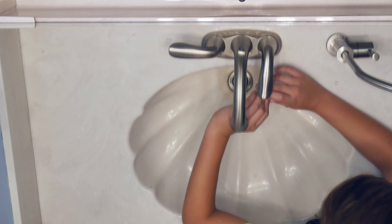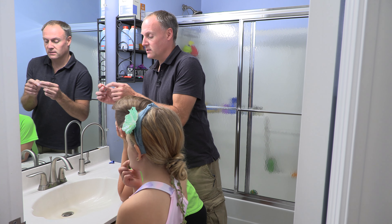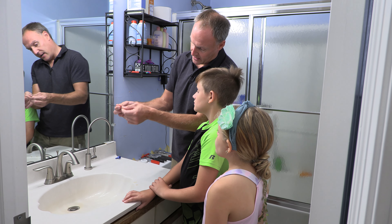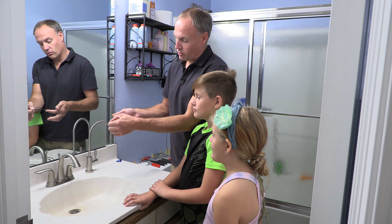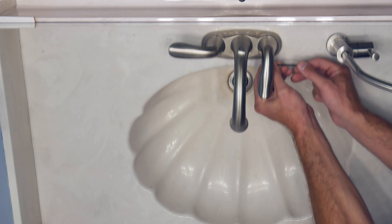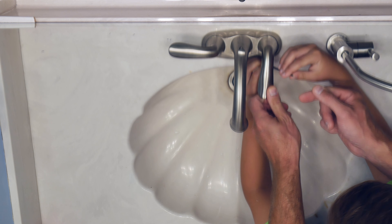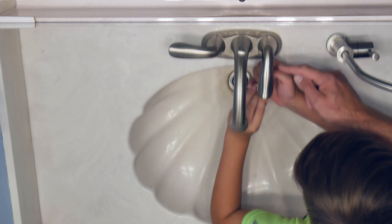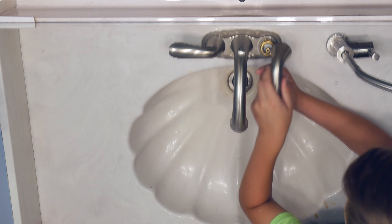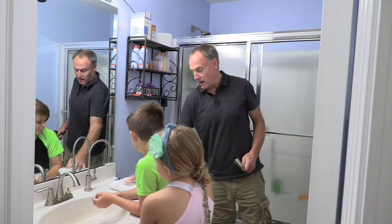Does it click in? Yeah. Sounds tight. If it's too tight and you can't break it free, that's why there are two ends to these hex wrenches — torque is force times the distance from the point of rotation. If you use the short end, it's hard to apply a lot of torque. If you stick the long end in, now the point you're turning is farther from the pivot, so it's easier to turn something that's stuck. I'll click this in and see if you can break it free using this handle. I heard it go click — it just broke free. Now that it's loose, put the ball end in and finish loosening it. Just a couple of turns is probably all you need. Now that it's loose, see if you can lift the handle straight up. Perfect.